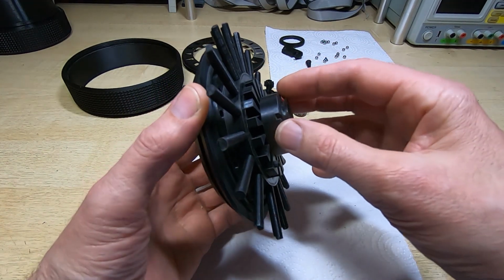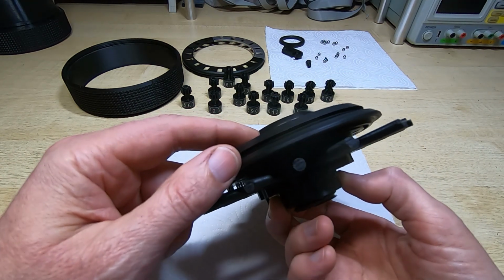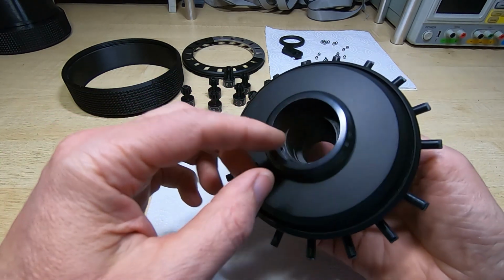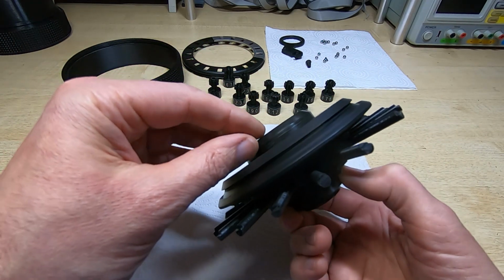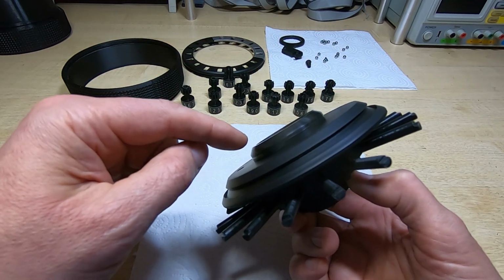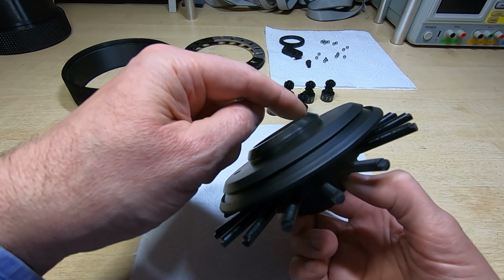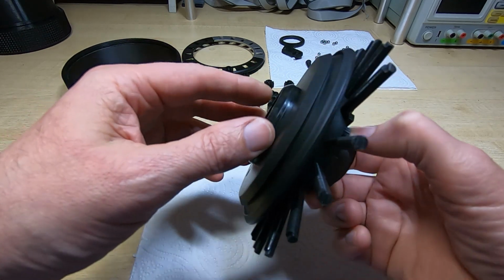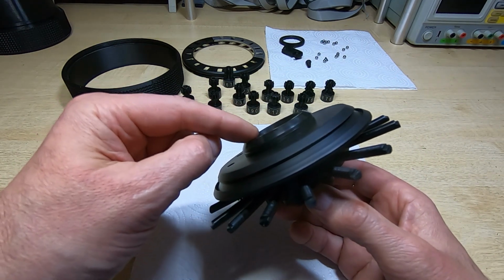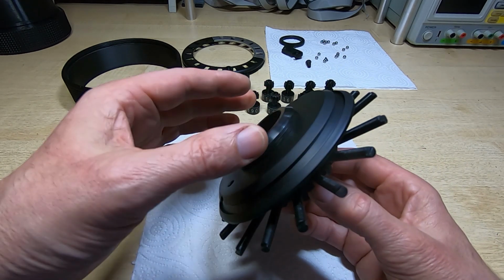To stop it pinching up when I tighten the nut, this nut's now fully tight. What I ended up doing was machining about 0.2 millimeters off the inside face, that's the top inside face of the central core, and I also measured the thrust washer all the way around, about 6 points, and it was, I think, 3.21 at one side and 3.15 at the other side. Might not sound like much of a difference, but you know, the options are you could have it very loose, which I don't really like, but I decided I'd rather have it nice and snug. So there's no real free play in this, it's all quite snug, but it spins freely.